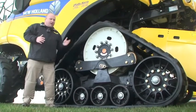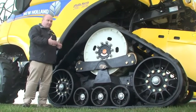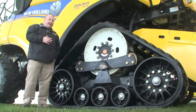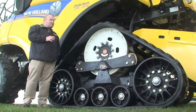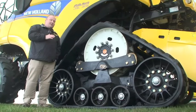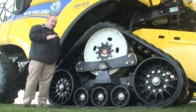It pivots through the centre and what happens is, in boggy conditions, the track unit itself will start to pivot up. One of the key differences on this new track model is in the transmission itself. What we've introduced is a variable displacement hydrostatic motor at the bottom end, which means that we can keep the combine running at full weight, climbing hills in the field and also get the high road speed.